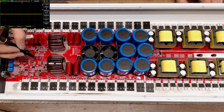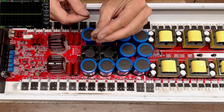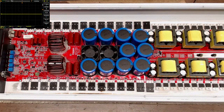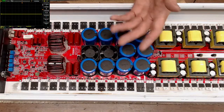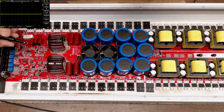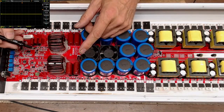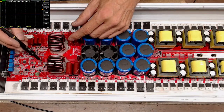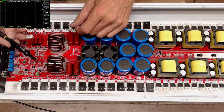After doing some digging around on this, trying to figure out which IC they use, because these ICs were marked C5, I started just going around each pad. Well, not really each one, because you get a general idea over time of which pad will carry a signal, usually between 1 and 8 on that side of the IC that has your input signals. And of course, you're going to have your VSS or VDD, but your primary goal is to find the pin that has your drive signal.